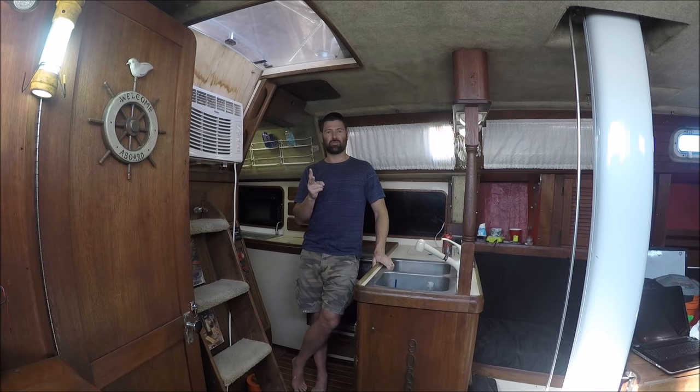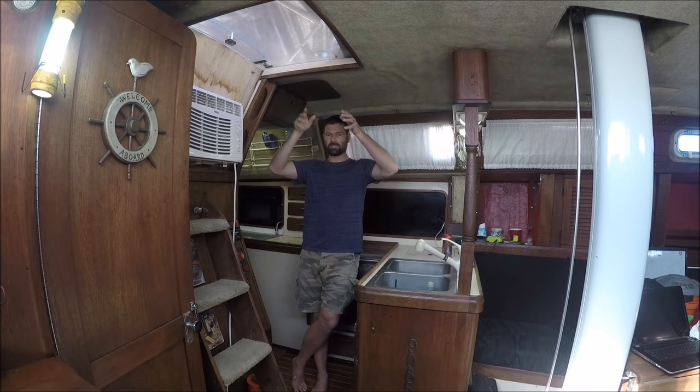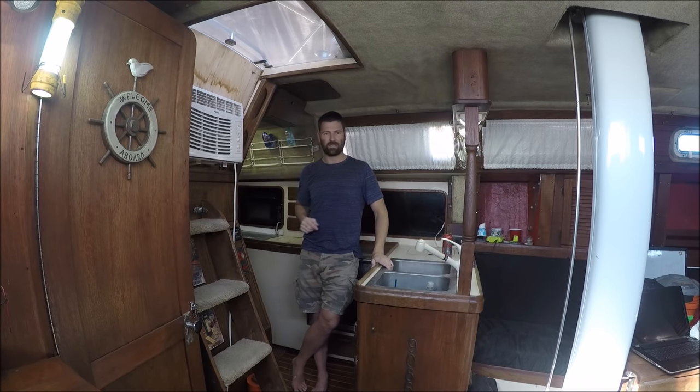The second two lights that I install are remodel cans. They're a little bit more finicky. There's just a thin rim on the recessed remodel can box. I think that's what you called it. They go up inside and that rim catches on the finished side of the drywall, then there's these springs that go up, and you can see that in the video.